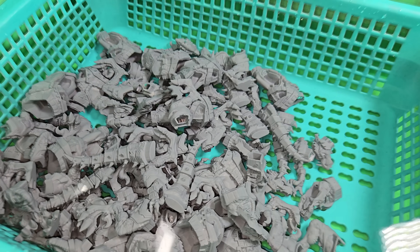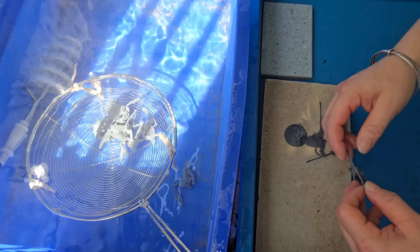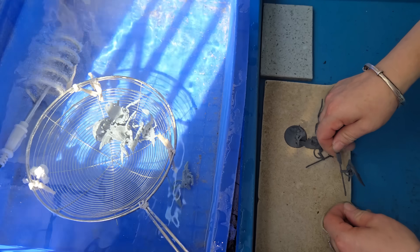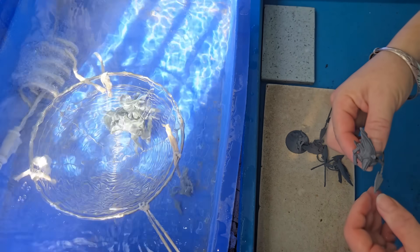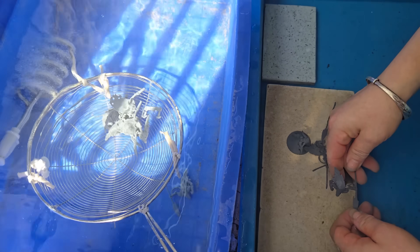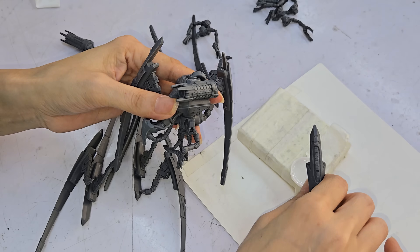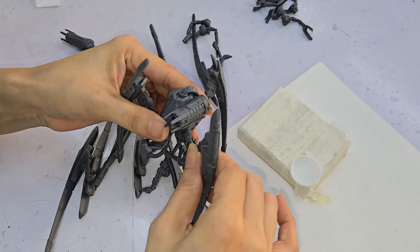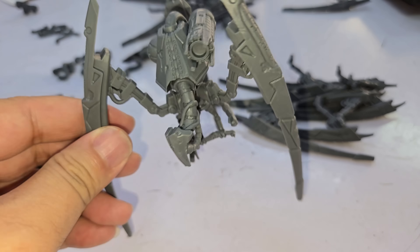The warm plastic is cooled with water. Some pieces like spears may be bent — these can be warmed up, straightened, and cooled again to fix them. All of these bits can then be assembled into complete models using a bit of superglue. And there you have it — that's how the factory goes from a digital file to mass producing PVC miniatures.